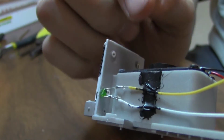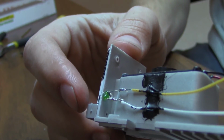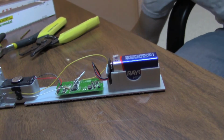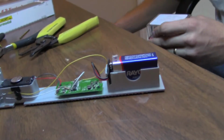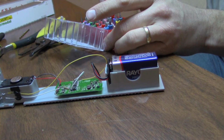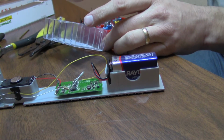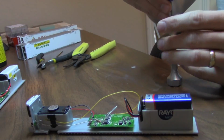Okay. So the hole that's going to be on the inside is going to be slightly bigger than the pilot hole that comes all the way through. So the pilot hole is just going to be a very small, probably number 56, 54 maybe. Not very big at all. And that just basically allows it to fill up with that thick gel glue, super glue that's going to actually glue the LED in anyways. 59, that's what that says, 59 on the drill bit, and I'll just go ahead and drill that.